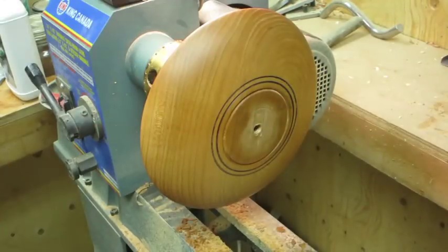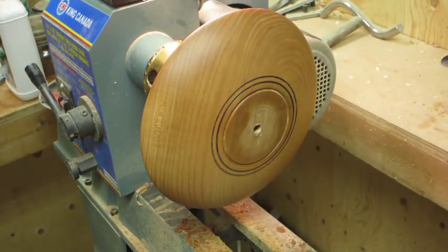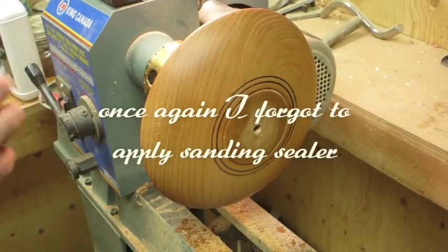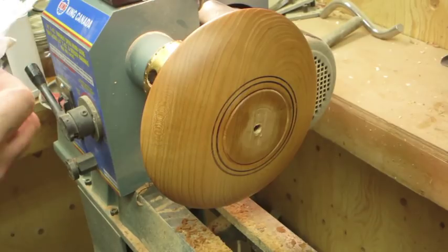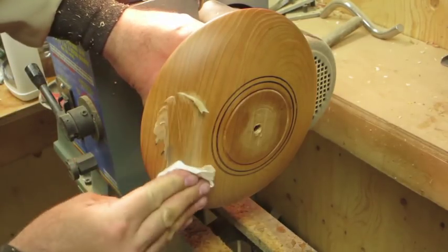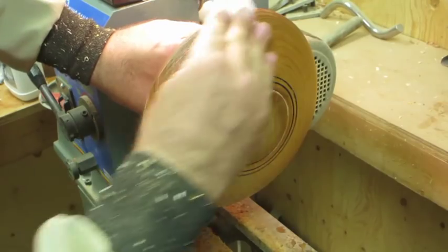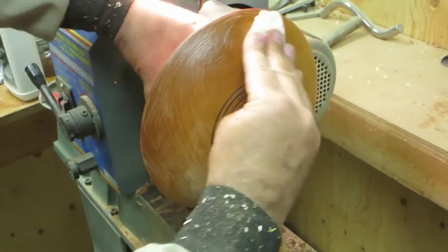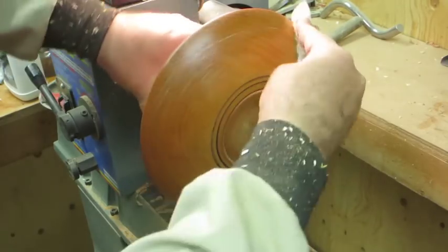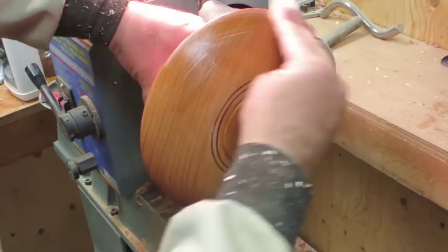I've got it sanded down to 320 grit, and I'm now going to apply some Yorkshire grit to the outside and get that foundation ready for Hampshire sheen high gloss. I'm going to probably give this three coats of Hampshire sheen high gloss once I've got it prepared. Now I really want a nice finish on this.